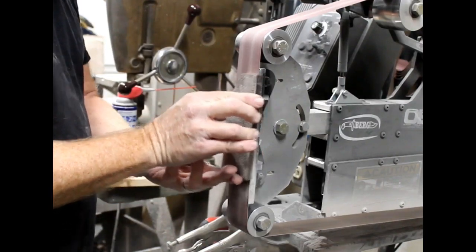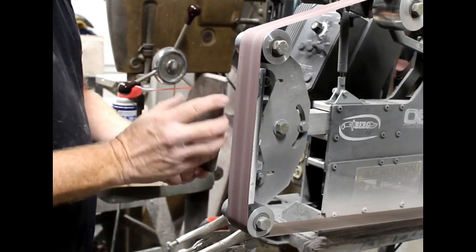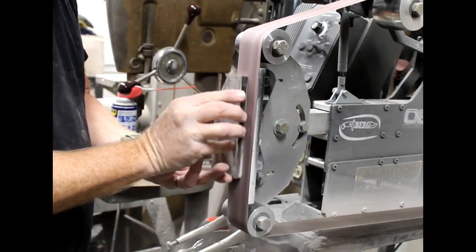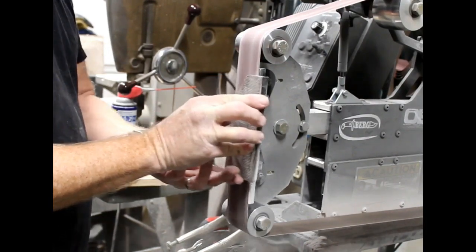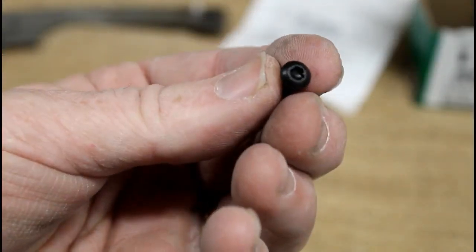Anyway, first step is to cut it into a usable size, and then you have to make sure that these scales are perfectly flat. Most scales have to be really flat to get a good seam between the scale and the tang of the knife. It is even more important on removable scales because any imperfection will really stand out.